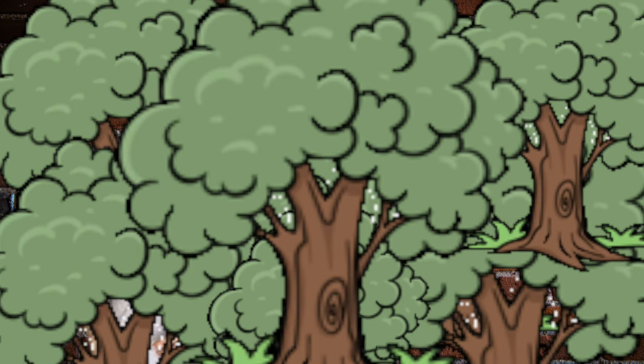In my time inspecting sites, the main thing people overlook when digging foundations are trees. Bear in mind that if you have a tree within 25 meters of your foundation, you should identify it and speak with your building inspector before breaking ground. This will save you time and money.